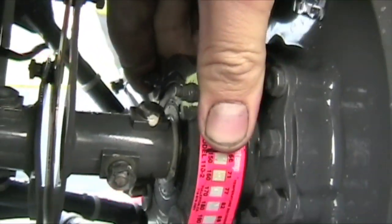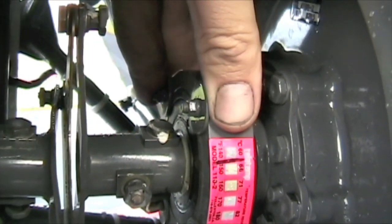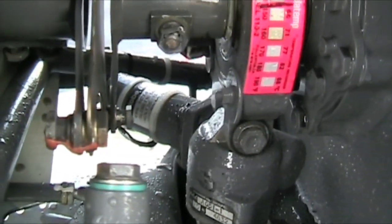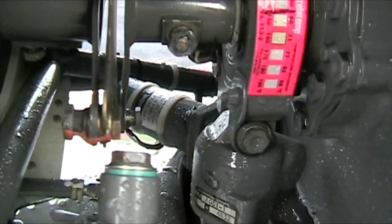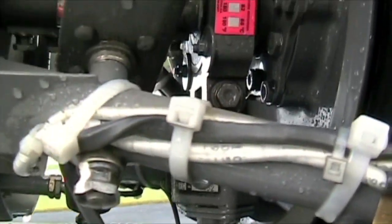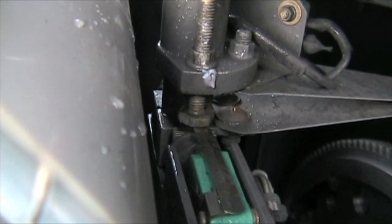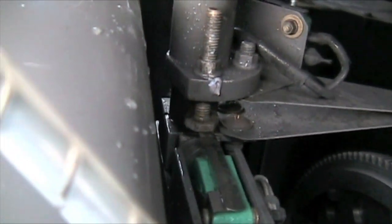Check for excessive play. This is a newer aircraft and it's just been overhauled. See that motor on the opposite side? That is the clutch actuator — what it does is it basically drives a screw, presses this column, presses the drive shaft up, causing the belts to get tighter. Here are the micro switches that basically tell the clutch actuator when to stop and when to start to re-tension.